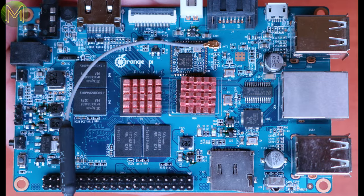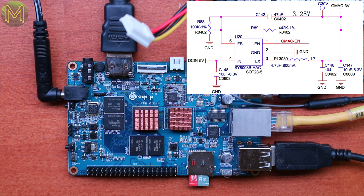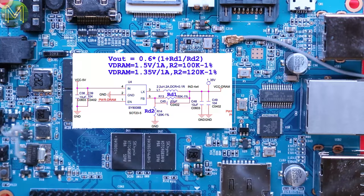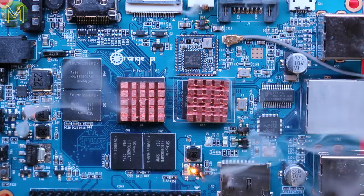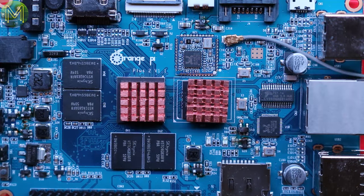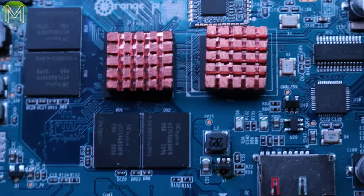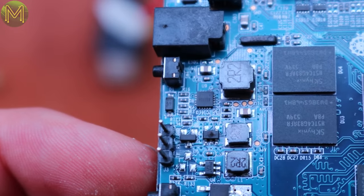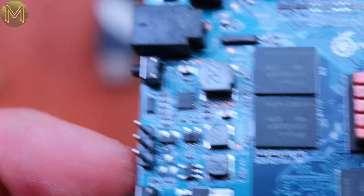So, what did I actually do to the board? Well, the first things to get hit are the voltage regulators, as they are the first non-passive component. First U20 went poof, and U24 one-upped with a spectacular display. U7 decided to join in, then U4 kicked in, along with more action from U20 and U24, and then they all just stood there looking embarrassed at each other. Since I applied three times the input voltage and the regulators were flaring for a while, it's highly likely the whole board is stuffed. I could possibly replace all the regulators, but it'll be forever dodgy. I have no idea whether a transient 15V made it to the MCU, which would have killed it completely.